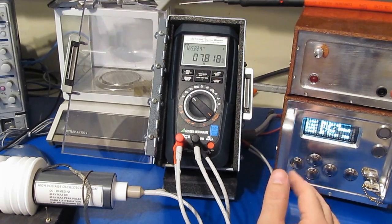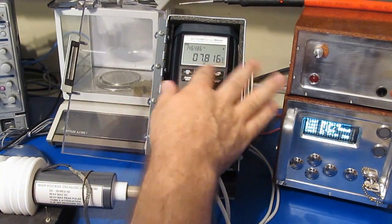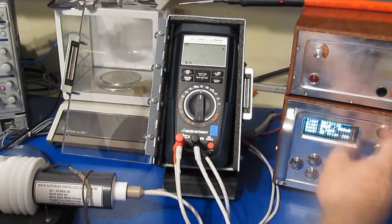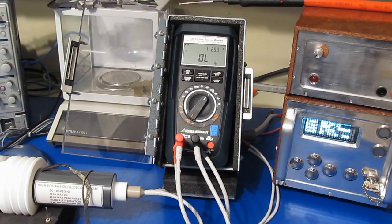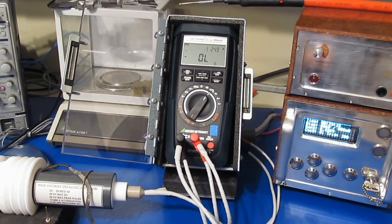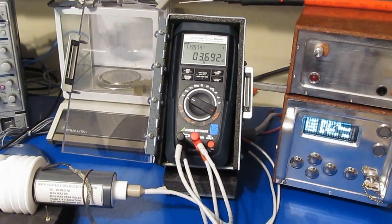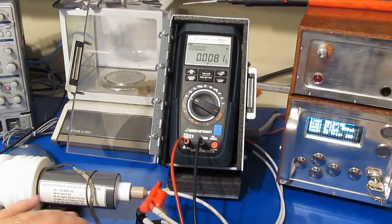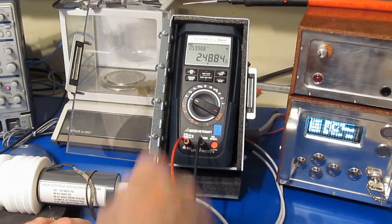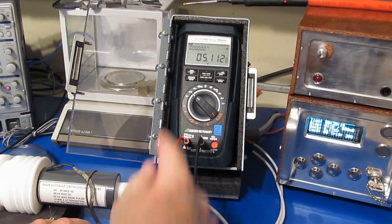Another difference with the IEC standard is they call out that the waveform be superimposed on top of the AC line. Here you can see I don't have any kind of supply voltage, and I don't test the current inputs of the meter. I'll go ahead and functionally test the meter, starting with AC volts. This should be roughly 2.5 - that's correct. You can see it's at 60 hertz - that's correct. With our bias it should be roughly 3.6, that's correct, and it should be roughly 5 volts - that's correct.